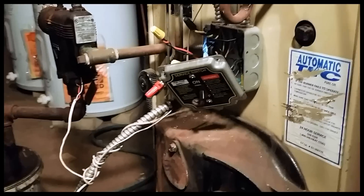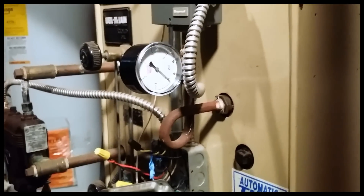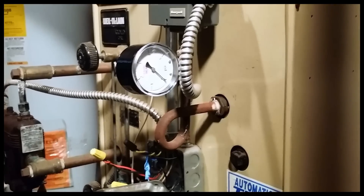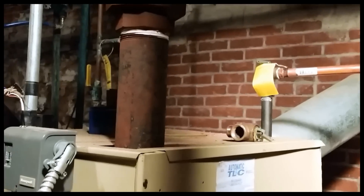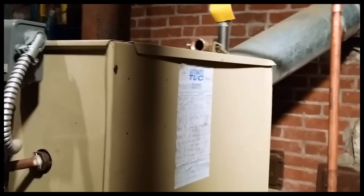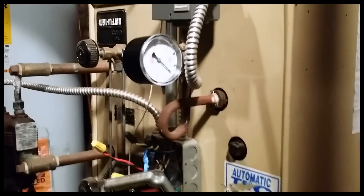Here's where we're at with the boiler. The furnace fires, but we have an interesting issue. We have a brand new pressure gauge that I put on — it's a zero to five pound gauge — and this thing doesn't really go up much above one. But the pressure valve, which is also brand new that I just installed, cracks at 15, and the pressure valve has cracked a number of times. You run it, it runs fine, the radiators get hot, but the pressure valve cracks and you end up filling the basement with steam. So obviously we have an issue here.